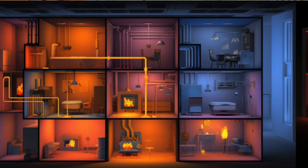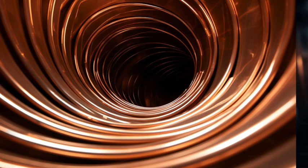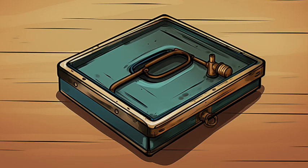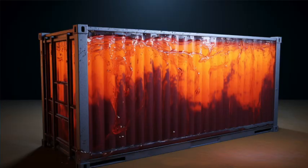The cheaper alternative is a hand-driven barbecue blower. Please note that purchasing through my Amazon link doesn't cost you more, but it supports me and allows you to benefit from my engineer's perspective. Another innovation is heat recovery, which can be useful for distributing heat from the furnace to multiple rooms instead of only one. This can be done by air ducts or fans. Another option is to heat water and use that to bring heat to other rooms through your existing central heating system, by installing self-made heat exchangers in the fume channel or on the plate of the furnace. You can collect this heat and bring it through radiators, or store it in a thermal energy storage — which allows time flexibility and ensures you have heat even when the stove is not in use.